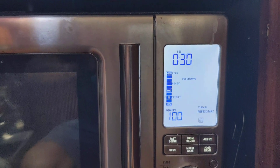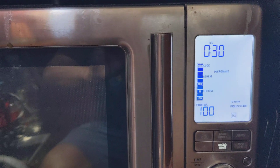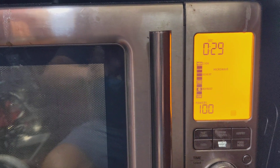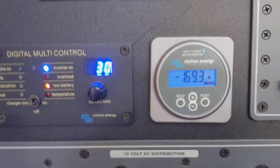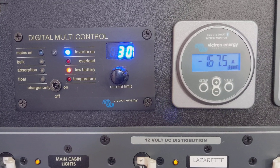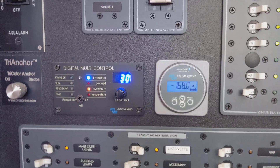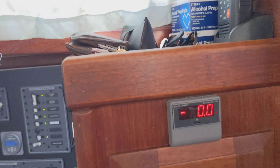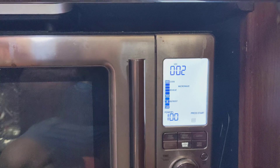Let's leave it at 100 percent. You can see that in addition to the seven amps that were coming out before, we're pulling out another 160 amps. I'm going to go ahead and shut that off so you can see — and nothing from the alternator yet, obviously the engine's not running. Let's go ahead and shut this off.